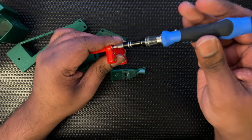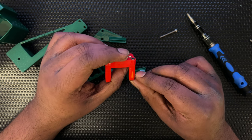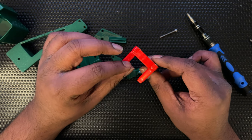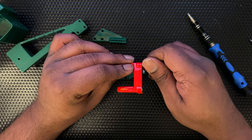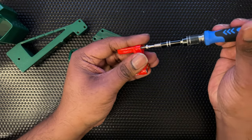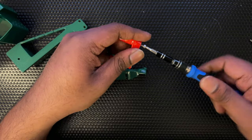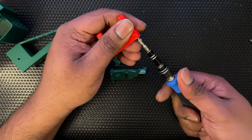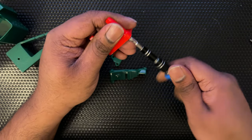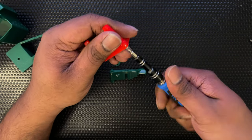For tools you probably need a 2.5mm and a 2mm socket. When I insert mine in — I already tried inserting one before making the video — it does discolor the part. There's discoloration on one side and I assume this side will match once I put it in. It's a really snug fit because we're threading a machine screw into plastic — it's not a self-tapping screw so it takes a bit of effort. At this point it might make more sense to use a hex key for more leverage.